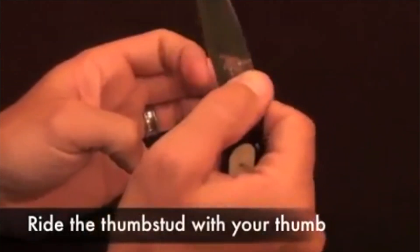That was when I started playing around with a button lock. At that time, all the button locks I could find were actually automatic knives — switchblades — which were and still are legal in some places. The button locked the blade open and locked it closed, and a coil spring would power the blade open when you pushed the button. I didn't particularly want to make automatic knives. So I took a couple apart, understood the geometry, and engineered a detent in the closed position rather than a full lock — so the button pushes into a detent to hold the blade closed, but you can override that by operating the thumb stud and manually open the knife without having to push the button.